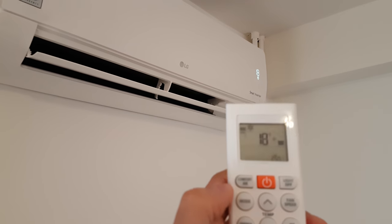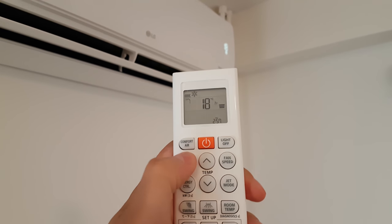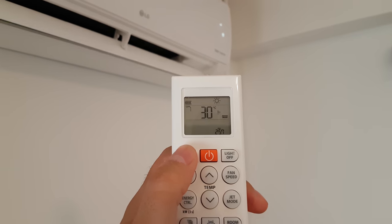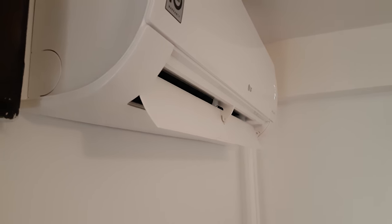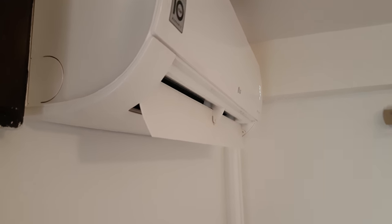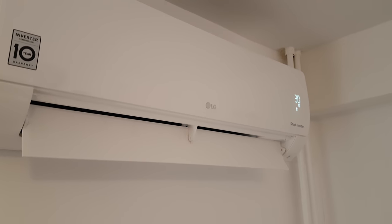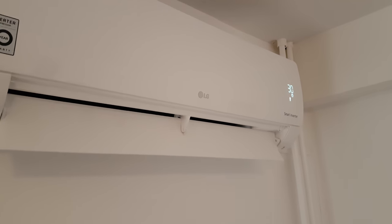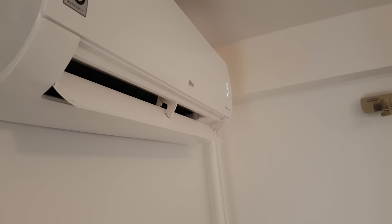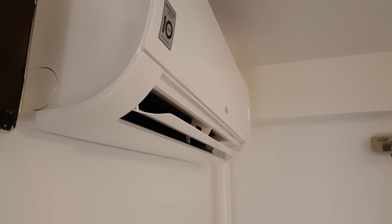This makes no sense because the compressor is off and the air is not heated or cooled. I can demonstrate this quicker by switching from cooling to heating. While the compressor switches, it will set the flap down for a couple of seconds like old LG units do, and then set the flap to its top 70-degree position. When the AC starts blowing hot air it will automatically lower the flap to its horizontal position, even though it's set to comfort air at its top position.